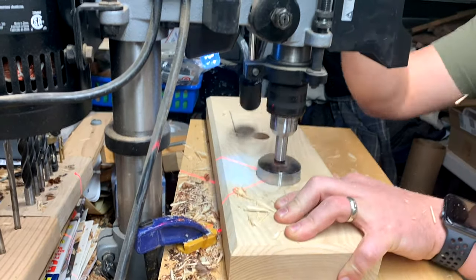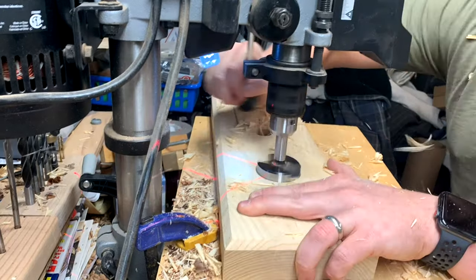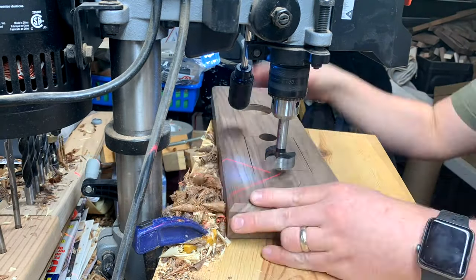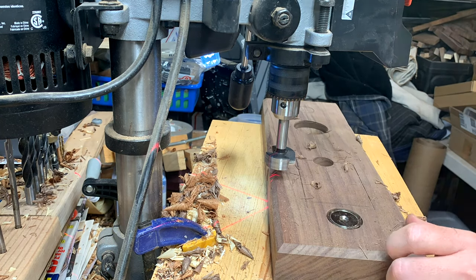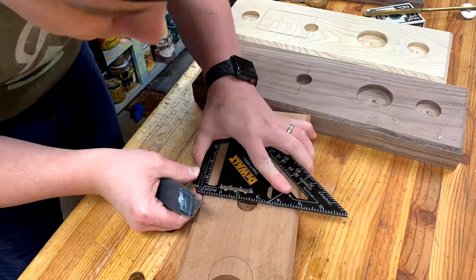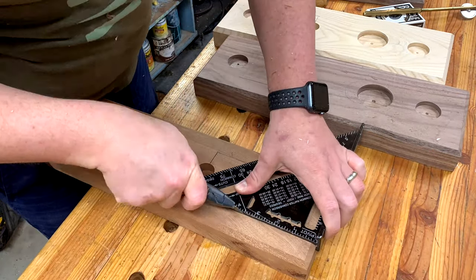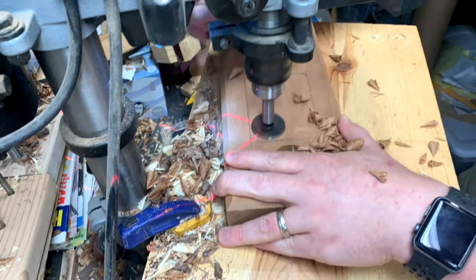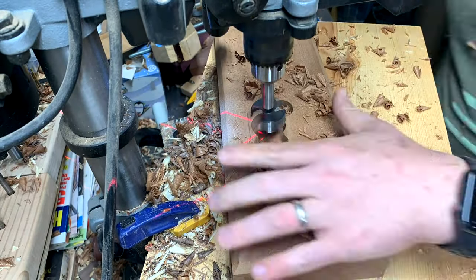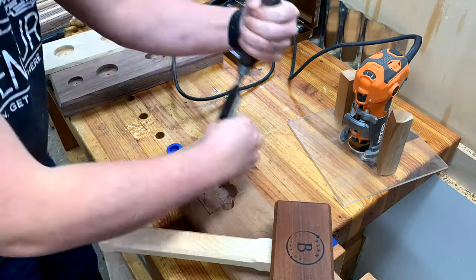Take it to the drill press and drill it out using your different bits. Test it out — with the pegs I don't need to go too deep, but have those pegs on hand. For the magnets, be careful not to go too deep — you want the magnet to sit flush on top. For the card storage, I recommend using a square and a knife to score it off first; that helps with the chisel work to make sure there isn't too much tear out. I like to use the Forstner bit to hog out most of the material, then measure how deep your cards are. The chisel is pretty satisfying — hand tools are great.